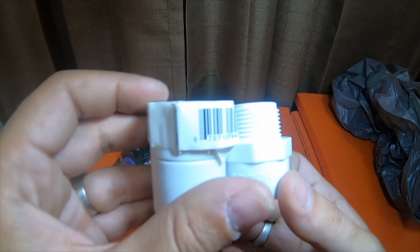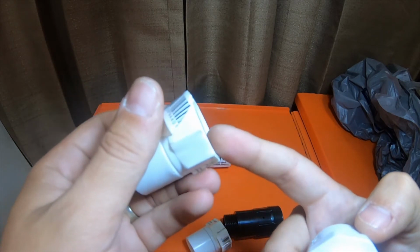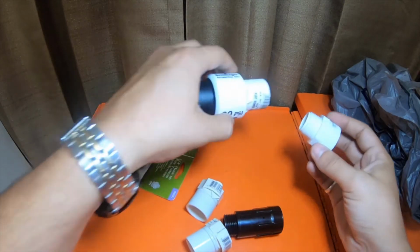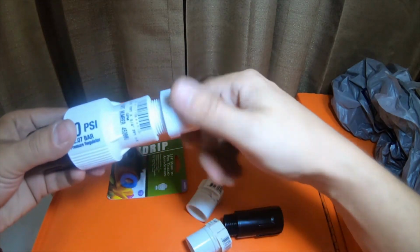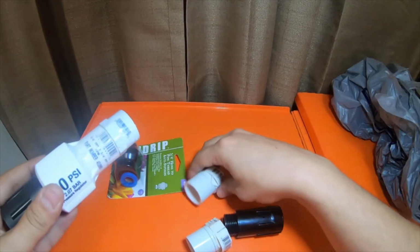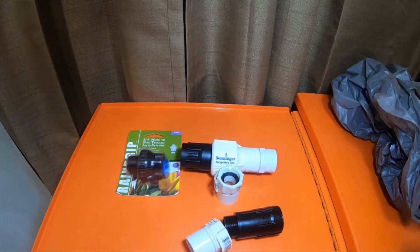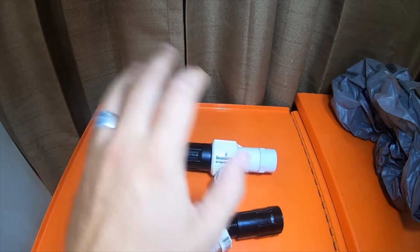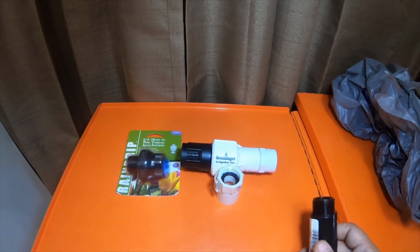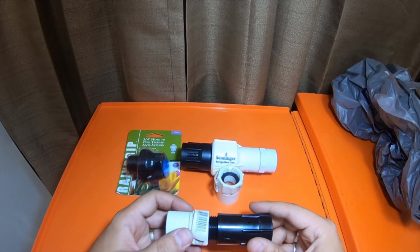And the difference is that the faucet fitting, the actual threads are a little bit wider than an actual pipe fitting. So pick these 3 items up from Lowe's. You can see how this one threads all the way down. It didn't thread all the way down in this one. So we picked these up. We're gonna experiment with them for the irrigation drip system that my wife wants, and I'm just showing you the other options that I have. And this would also go with the previous video from all the stuff that was picked up at Home Depot.